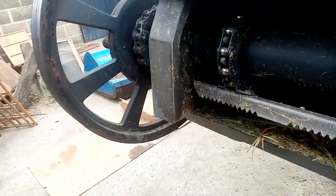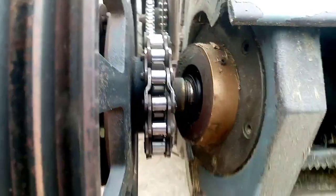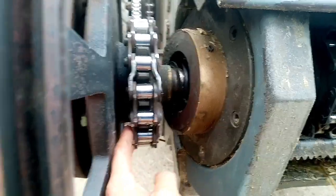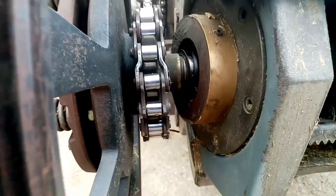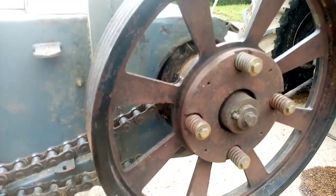Whether that's repairable, I hope so. It looks like this whole shaft's got to come off probably. I think it's been moving like that for a little while. I think we can say this bearing's knackered. That should be sitting right in here — it's properly, properly buggered.